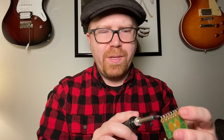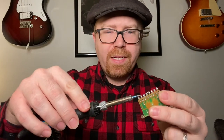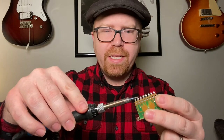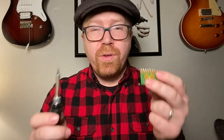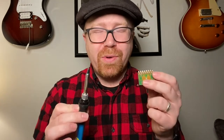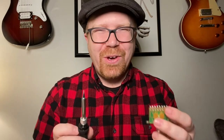You don't want to hold the soldering iron on there too long because you could fry the circuitry. Just a little bit and it's done — it's really quick. It will stick there. If you touch the surfaces first and get them a little warm, it might stick a little better, but that's not necessary. Don't hold it too long. Now, if your wire's already together and you need to completely replace the switch like I did, just touch the iron to the wires that are already connected — it'll only take a second and that wire will come loose. Before you do any of this, take a picture of what your wiring looked like, in case you need to put it back the way it was, or in case you totally mess it up and have to take it to a professional.